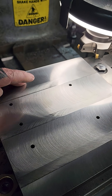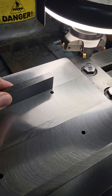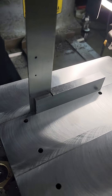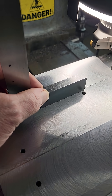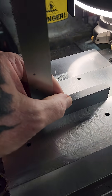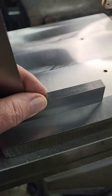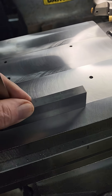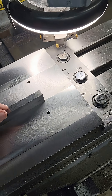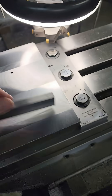I've made my first pass, got a step, and now I'm sweeping the cutter into it — it seems to have done a pretty good job. If you take your straight edge, fat end down, and set it right on the edge there — that's pretty flat. Same thing there. Now on here, not so much. So this area is good.